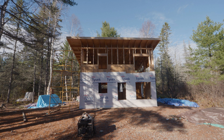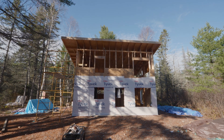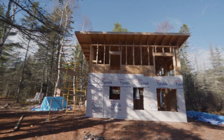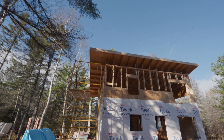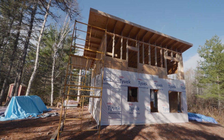Here's where we're at — we got the roof on. I basically just hooked sheathing up to Jeff, and his friend came up to help with that part. Then we have to get the ice and water shield up on the roof, then finish it, wrap it, and wait for the windows. We're sitting pretty good.